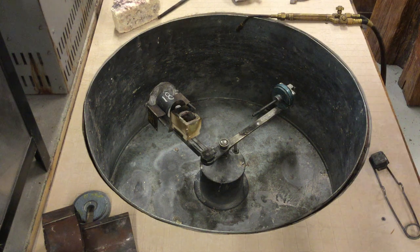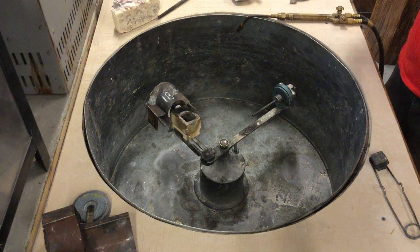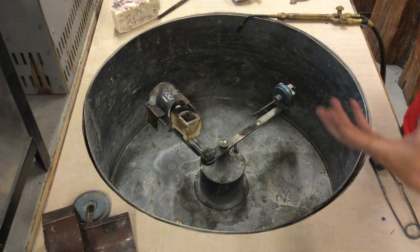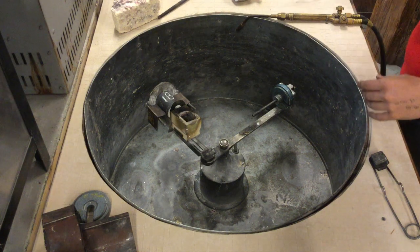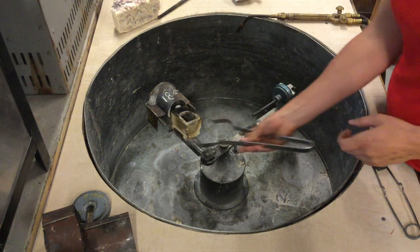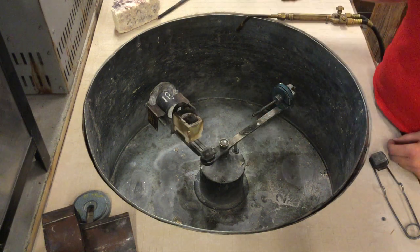I prefer a level five shade. Depending on your eyesight, you may want a level three. But what you don't want is for your eyes to hurt from looking at the light while wearing your eye protection. This is just like staring at a computer screen — if your eyes are hurting, it is too bright and you need stronger eye protection.